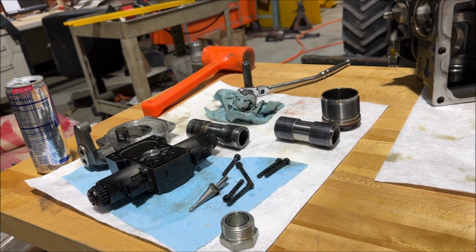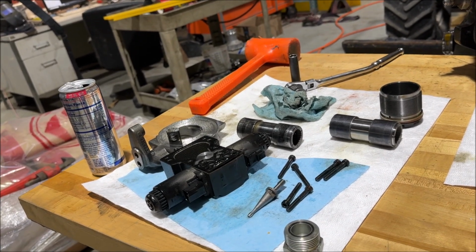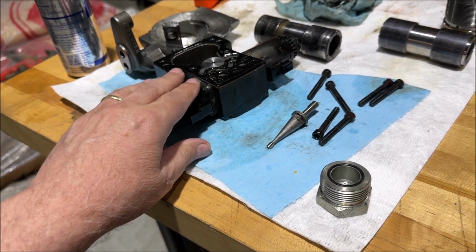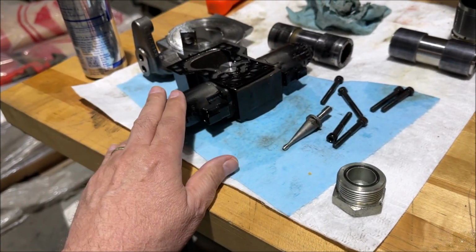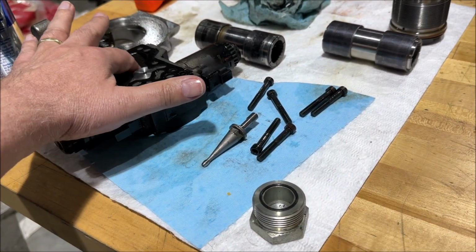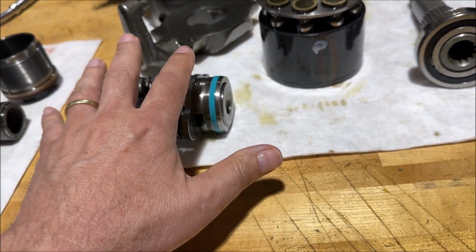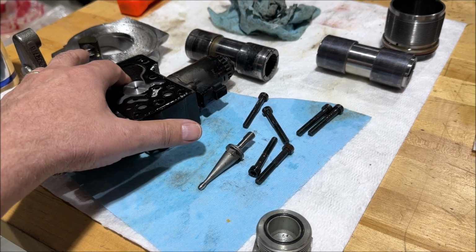Motion control says, oh, pedal's been pushed a little bit. I need to make a little bit of a pulse going to, say, this solenoid so he can move forward. And he only pushed it down a little bit, so I'm just going to send out a little spiky pulse and wait, another spiky pulse and wait. And what those spiky pulses do is they put a little bit of pull on the electromagnet. And so it's a variable amount of pull. That's why they call it an electroproportional control valve. And so that pulls here. This checks the feedback little finger there, and it puts a little bit of pressure into this piston, which then moves the swash plate a little bit, and then it can tell that it moved, and so it stops it from going too far.